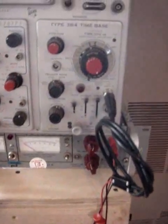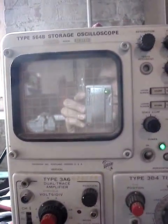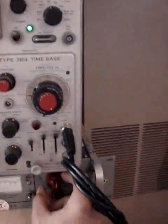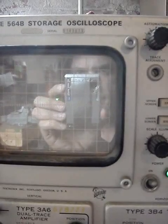I also checked this — don't rig this up at home unless you are me — but if we use the external voltage input to the time base and switch down to that, you'll see that dot stop. That's supposed to happen. Then adjust the volts per division. I've rigged up a 0 to 20 volt supply into that horizontal input, and you can sweep that dot through its little trouble spot using the horizontal input.